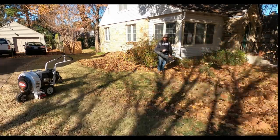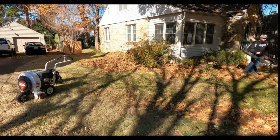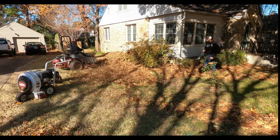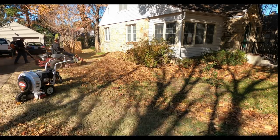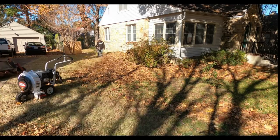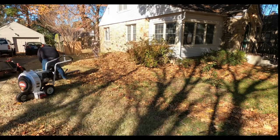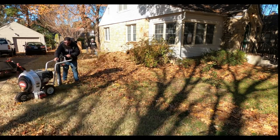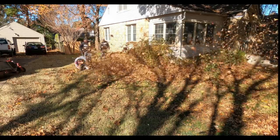That parking lot blower is a monster. When it's pointing forward it's pushing a lot of air — if you just have it sitting on the grass blowing forward, it will actually push the machine back. Using a mower like a plow works pretty good, but the leaves were so thick here it was lifting up my deck. The 36-inch walk-behind works really well as a plow — it has about seven height notches using pins, and if I move it to notch three it puts it close enough to the ground to just plow leaves like crazy.